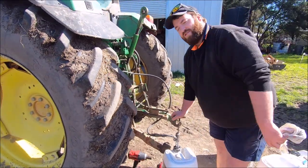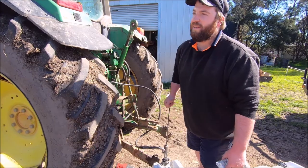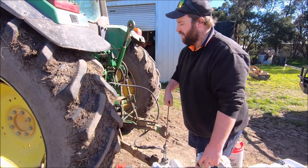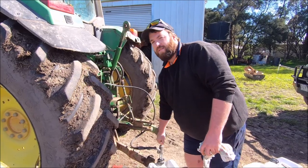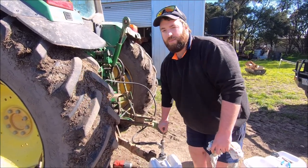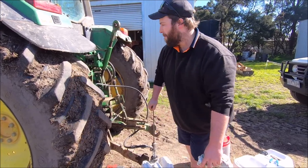Alright, that's finished. Dropped the oil, he's put two new filters on, so I just gotta fill it up now. That'll take a little bit, takes about 58 litres, so fill it up with oil and then run it. Then we'll check the level again and just top it up a little bit once it's filled those filters up fully. So yeah, backing them out.